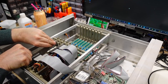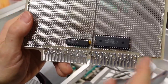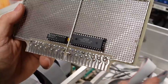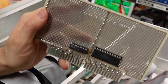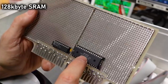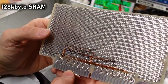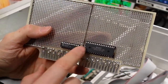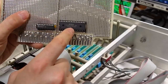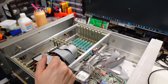There's another one of these homemade cards right here. This one hardly has anything on it. Looks like it's got a flash memory chip and a 74F540 — so this is from 1986. This machine was used into the 80s. We have a Sony CXK581000P-12 — I'm pretty sure this is an SRAM chip. So this is just some select logic, rudimentary address line select logic, and this is like an extra RAM expansion card. You just need two chips — something to select it when the machine is accessing that memory space using the address lines. That's all it really takes.